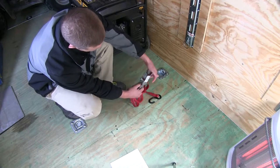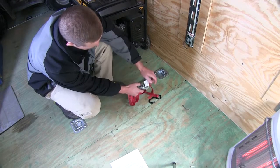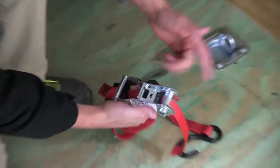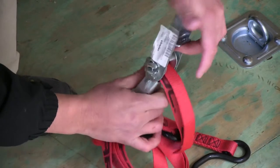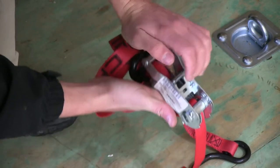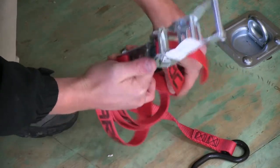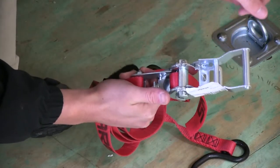There are two basic things to know about how to work the strap. It ratchets, and when it does that, it binds the strap up and tightens it down. There are two levers: this lever on the top side allows you to open up the strap without ratcheting it, so you can pull the strap tight or loosen it without having to ratchet it up.